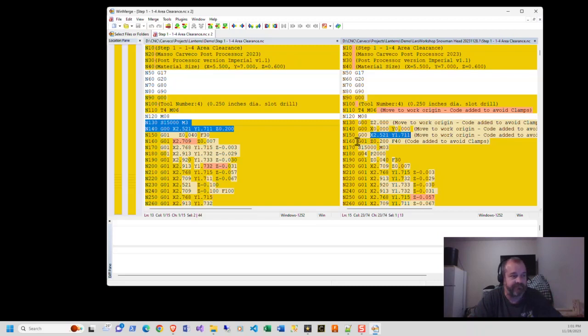Just to say. At that point in time, we're going to drop down to 0.2, just like they're doing here, but we're doing it in a different order. It's sort of like homing your machine. You're going to home Z, and then X and Y could happen together, or you could do X or Y, but all three of them being done at the same time is usually not a good idea. Now, if you're cutting, whatever, that's fine. I'm just saying if you're just moving the spindle or router around.